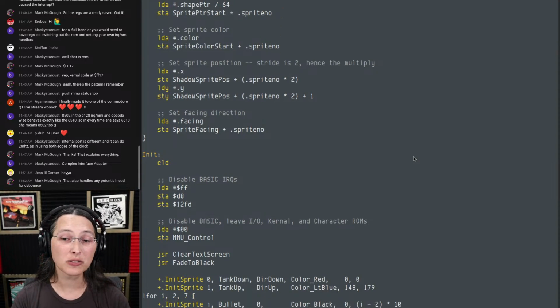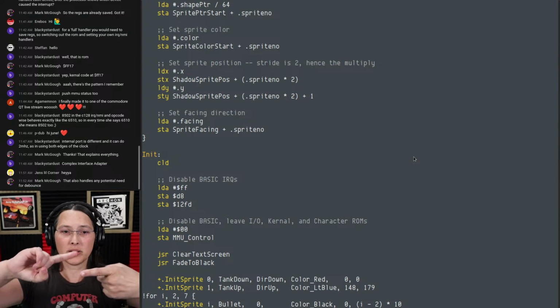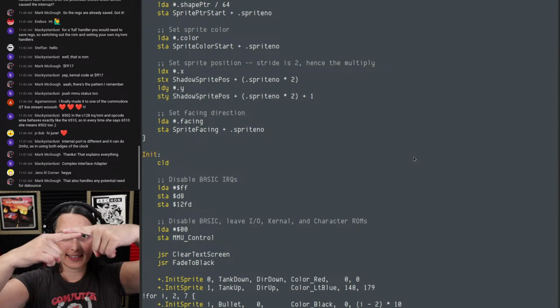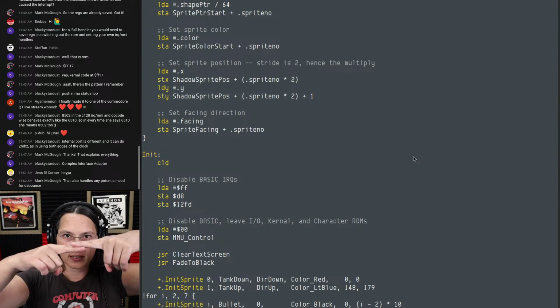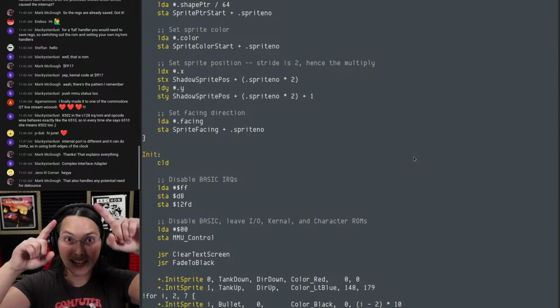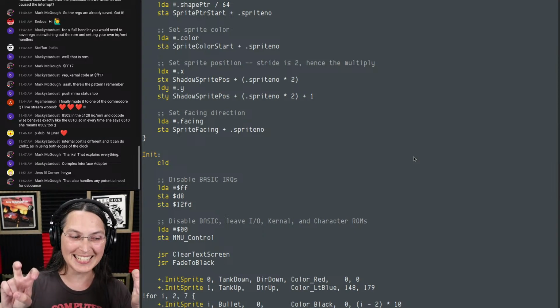So for those of you who are not familiar with how switches work, remember, you're dealing with 2 pieces of metal. At some point, those 2 pieces of metal are going to collide to close the switch. When that happens, you can't see it, but what's happening is those pieces of metal are bouncing against each other. And when that happens, they're doing like this. So they're making and breaking the circuit over and over and over again. And so from a switch perspective, it is actually possible, because our CPU is moving 1,000 times a second, to read both 0s and 1s while we are bouncing. So you have to de-bounce the switch.